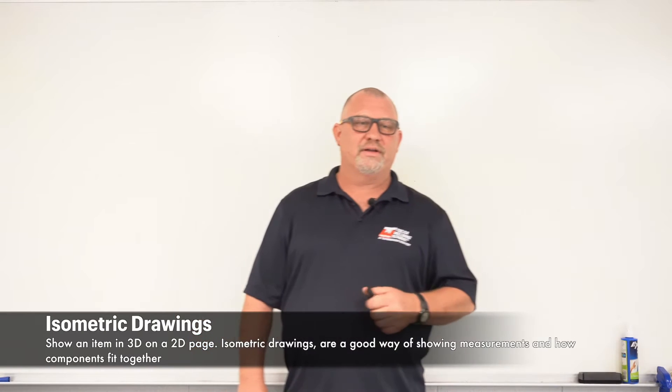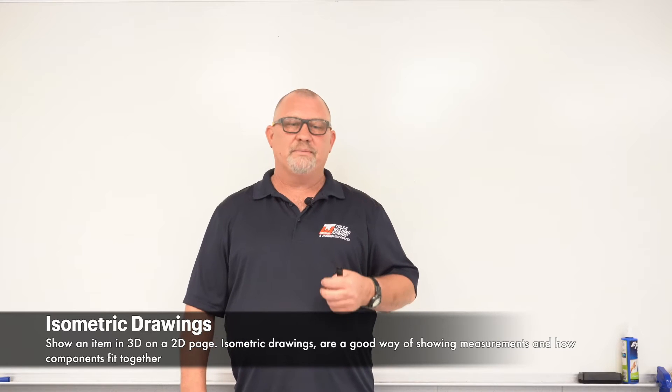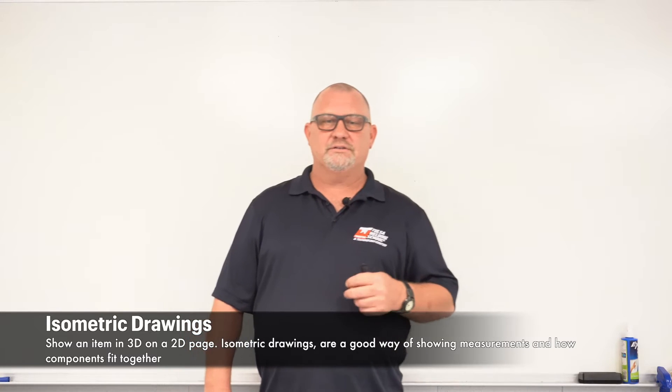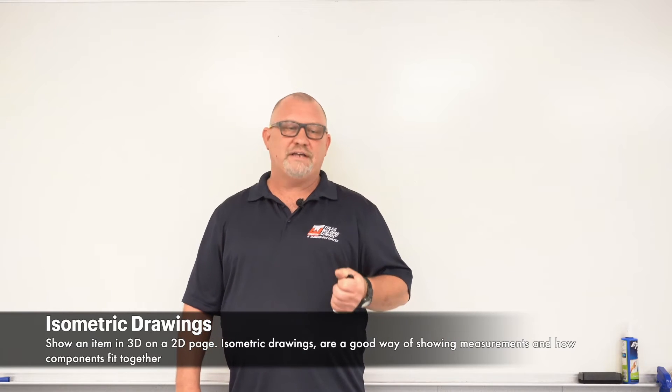Remember, this is just a crash course. There's a whole lot more to it — depending on how many likes I get on YouTube, I will do some more. What is an isometric drawing? It's a 2D drawing used to represent a three-dimensional object. It is not to scale, but the information is true and accurate. With this type of drawing, the fabricator can see and understand what is to be built.